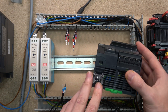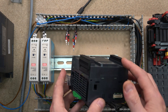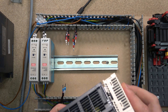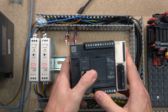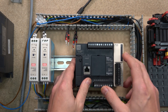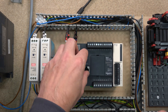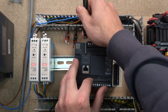Power goes in right there - 24 volt DC. My particular controller is 24 volt DC. Here is another slot where you can add additional expansion cards, which we're going to add right now as well for use in a future video. Just plug it on. As you can see the card color is white - that doesn't mean it can't be used with the controller. This is the newer controller and this is the older one; they changed the color but the whole thing is functionally the same.